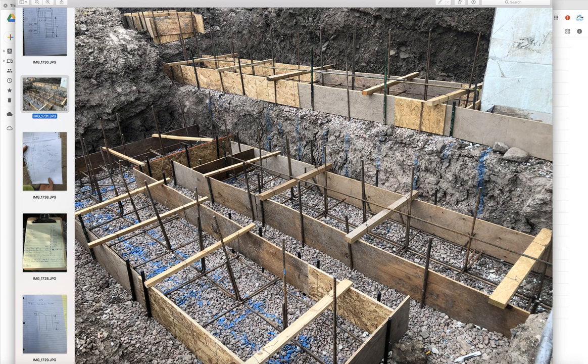So here's the scissor stair again — footer, footer, slab up here — and then you'd walk up the rest of the scissor stair, and then there's a retaining wall there. So that's what we're doing. We have all this bar in here, as you can see, coming four inches from the edge.